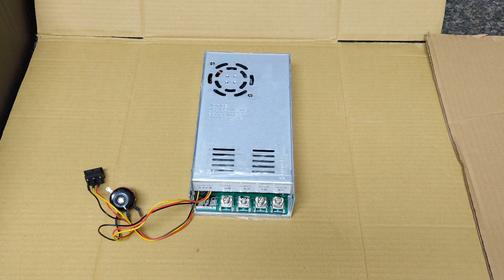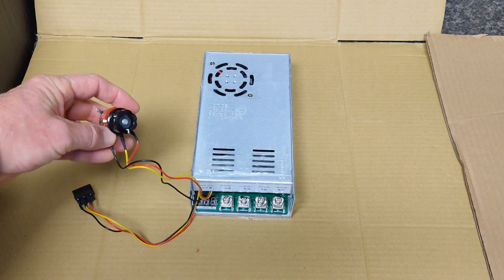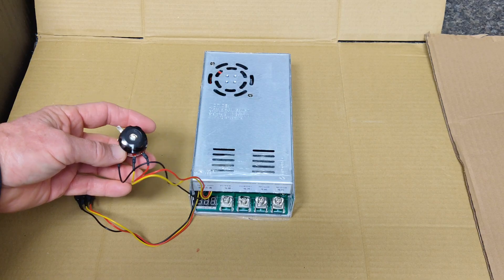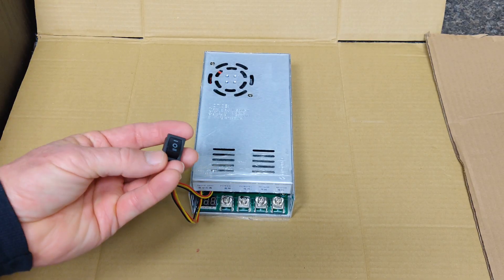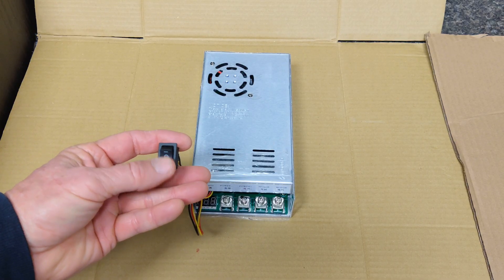This is the main part I'm going to be using in this project. This is a 12-volt, 100-amp continuous, 200-amp surge PWM or digital speed controller. It is bi-directional, and these are the components to it. This is your speed controller potentiometer, and this right here is your directional switch, which I will end up replacing. Its positions are forward, neutral or standby, and then reverse.